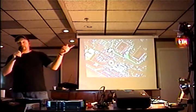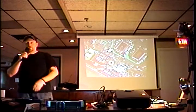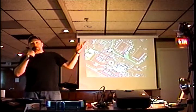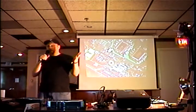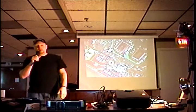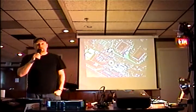Hopefully it'll say erasing and start running asterisks across, showing you 10%, 20%, whatever. And then it will say done erasing. And then it will say that it's flashing, and hopefully that process finishes. Because if it stops in the middle, your power goes out, your little brother kicks the power cord out of the wall or something like that, and it's not finished, you're probably screwed.